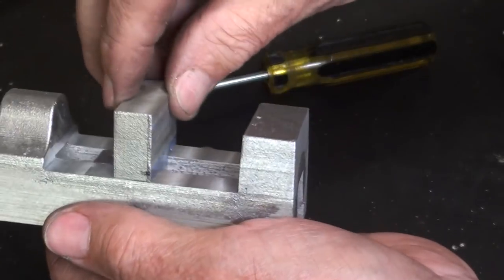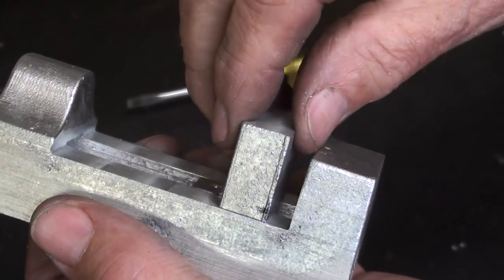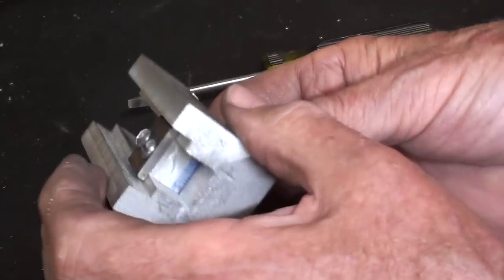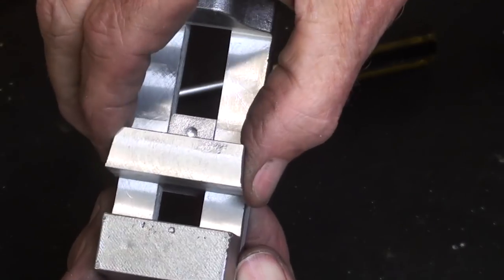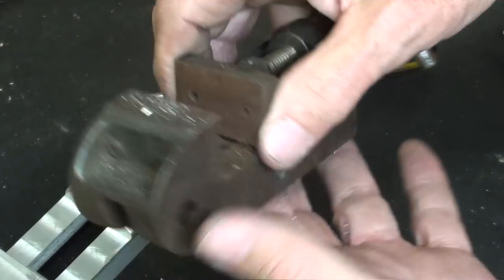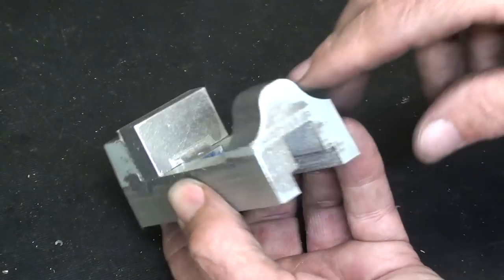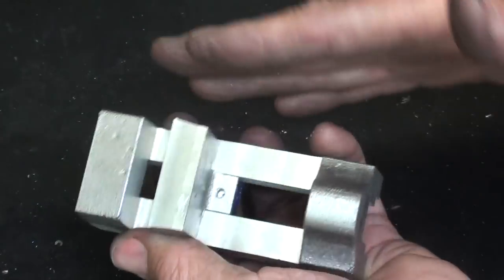When you tighten those up, the jaw should still slide freely, and I've got a real good fit. You're going to have to have just a little bit of slop and play, or it will trouble you later on. That was a very difficult thing for the kids to do — to get that dimension right. I used a depth micrometer to measure it; it really has to be right on, and there's very little play this way, but yet you will see there's always play in commercially made ones. There has to be — they're fighting tolerances also with semi-skilled workers. Well, that's just about enough fun for today. Tomorrow I will continue by making the screw, then drilling and tapping this hole and drilling it on into the jaw. The final operation will be milling all of it smooth.